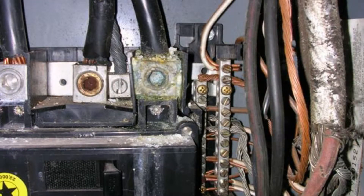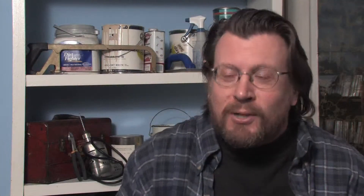The basic function of each of those wires: the black wire, also known as the hot wire, actually carries the electricity into your house and allows it to be used by your appliances, your lights, fixtures, etc. Your neutral, or your white wire, basically sends the signal back to the service panel to tell the circuit that it's been completed. That's about the simplest way I can describe that.